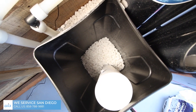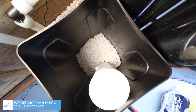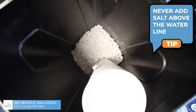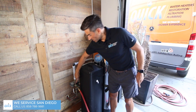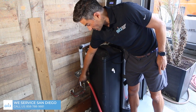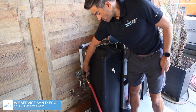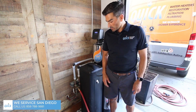All you're going to do is dump it in the brine tank. For demonstration purposes I went above the water line — I don't recommend doing this. Just use one bag at a time and always keep it below that water line. I want to make a quick note about this valve. Whenever we do an installation, you're going to see this — it's actually a purge valve so we can block the flow from going into your home and service your unit. It also allows you to hook up a garden hose and wash your car or anything you want with soft water, which is pretty cool.